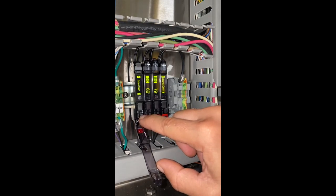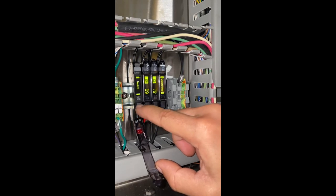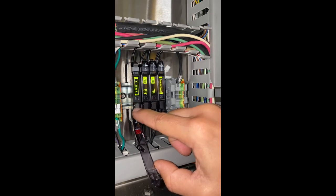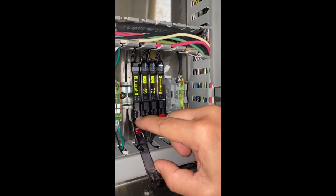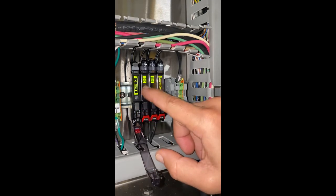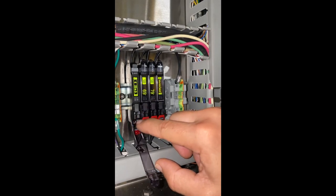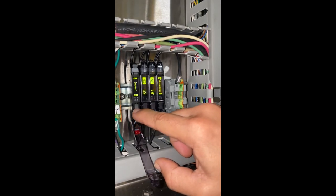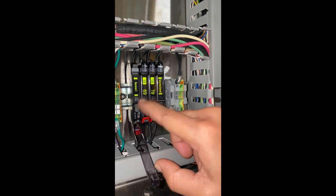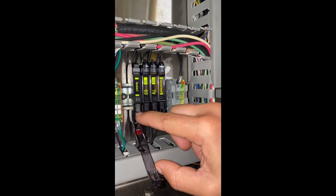Press mode again and you have the output timer. Duration one is how long the sensor needs to be active before it sends a signal — the standard is 10 milliseconds, this one's already set at 200 milliseconds. This is the on delay. Duration two is the off delay: once the sensor is active, how long until it turns off after the object is not present.